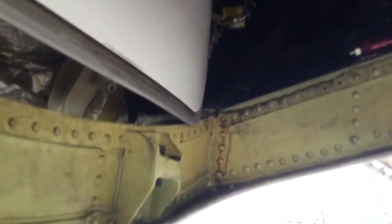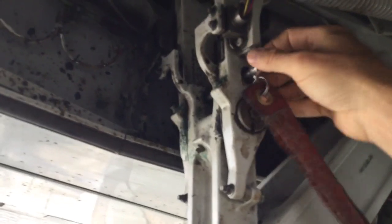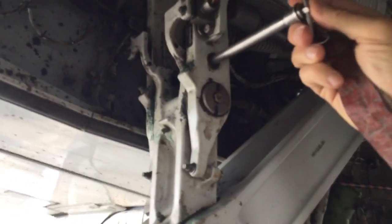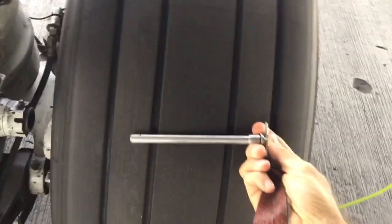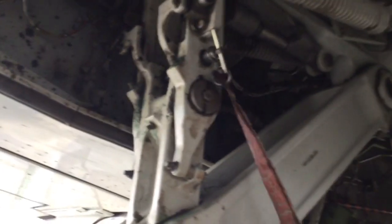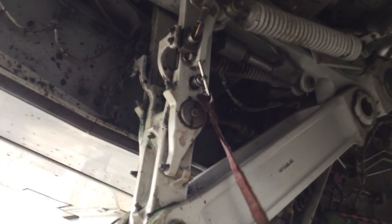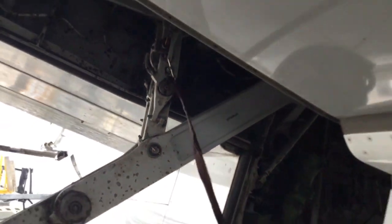So I have to wonder if there's any problem doing that with controllability in negative cases. Here's the right gear pin — I'm going to remove it so you can see the pin itself. That gets put in on every turnaround, and then they put it in the equipment bay, wrapped up and loose. So I'm not sure if that's a good idea. I contacted Boeing back in September 2017, and Boeing said: we don't recommend it.